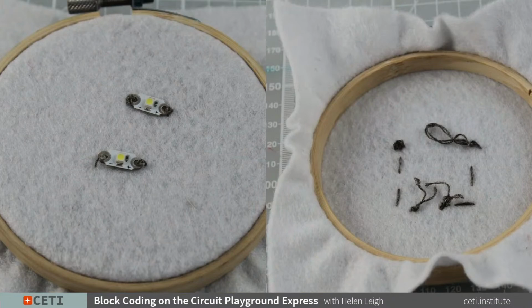Can you go back to this? So this is the other thing you need to really watch out for. Remember I was saying short circuits and loose connections are usually why things don't work. So when you are sewing components, when you're sewing your sequins on, if your connections are not tight and secure, like these, you can see the top one is securely fastened. You've got 3 or 4 stitches securing the component to the fabric. And the second one is not very well secured, and it doesn't work. So you want to make sure that the component is nicely stitched down before you tie off.